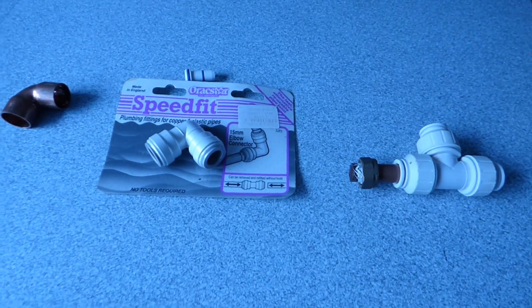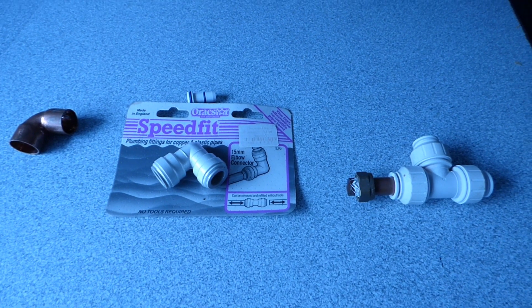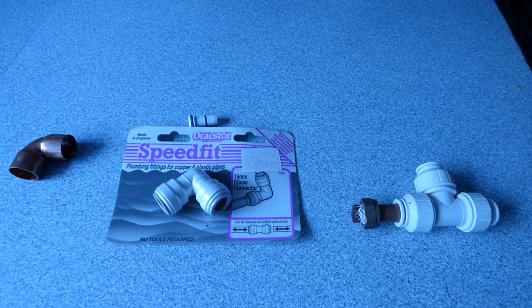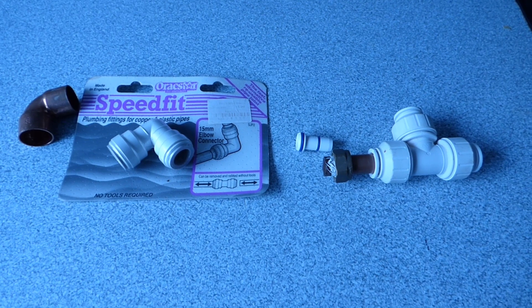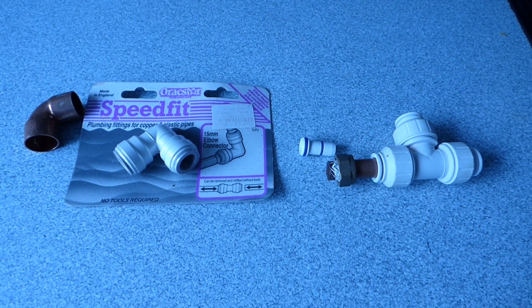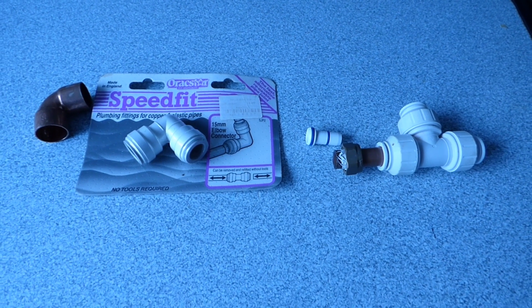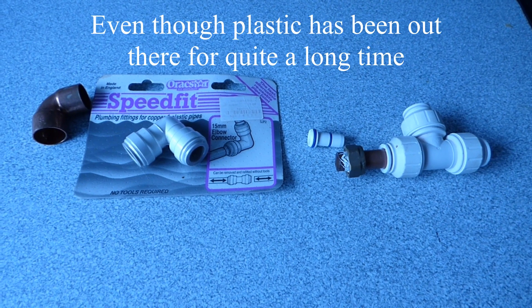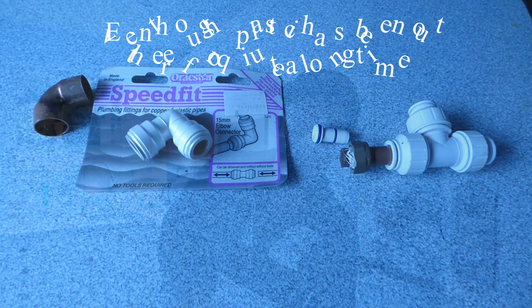Once it's soldered, copper very, very rarely ever leaks unless it's been badly soldered and not tinned properly. Usually once copper's in, it's in. The only other things with plastic — I did have a house a few years back that had mice and they chewed through the plastic pipe. And the other thing is, will the plastic get brittle over time, over a few years maybe? I haven't known it yet, but I guess it's just new technology versus old. We know the old has years behind it, and the plastic is relatively new.